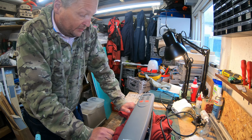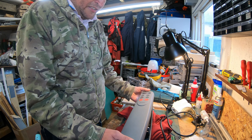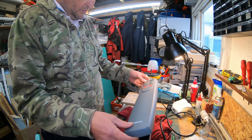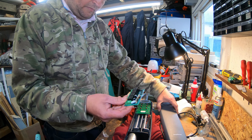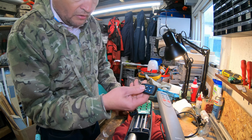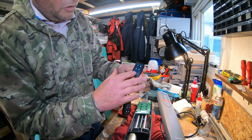Today I'm actually doing a DIY mod on an autopilot. This is a Raymarine ST1000 autopilot — basically this. I've already removed the cover. What I'm going to be doing is adding this PCB, which is going to allow me to operate it via remote control. This is the four-way version. They do two versions of this remote unit.